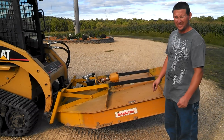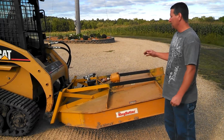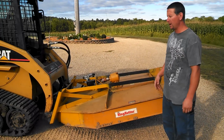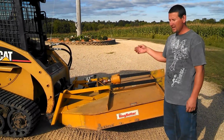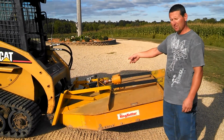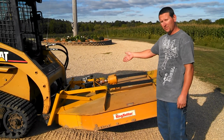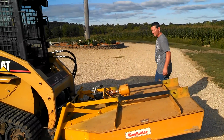I contacted everybody I could, and everybody said it couldn't be done, even though we know these machines will run it. Fabco, Ronco, all the hydraulic specialists couldn't do it. I called Surplus Supercenter and told them my flow, my PSI. They sent me a motor, I believe it is a 6.2, and they sent me all the stuff to do it, and it flows and works perfectly.